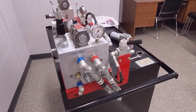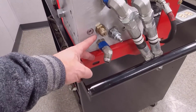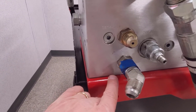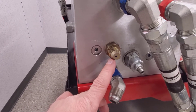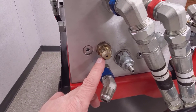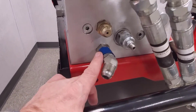Let's talk wing lift on our high float hydraulic block. We have our opener depth circuit engaged in the same direction all the time — pressure and return from the tractor. Then we have two half inch lines coming from the tractor as well, going to the TR-TRWLP and the TR-TRWLR. Pressure goes to the base end of the cylinder. When the wings are up in the air, the base end is what pushes the wings out — the base end is connected to the inner wing and the rod end is connected to the main frame — and that effectively pushes the frame sections out.